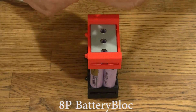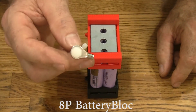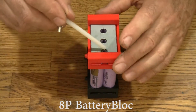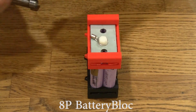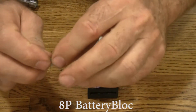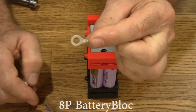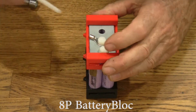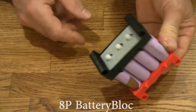Now we go with the nylon bolts. All these battery blocks come with enough ring terminals to make a battery. Here's a power terminal — we'll put this in. And here is a sensor terminal; this is a little ring terminal for a 14 or 16 gauge wire. It comes with those two. Here's just a plain nylon bolt. There they are on the other side.